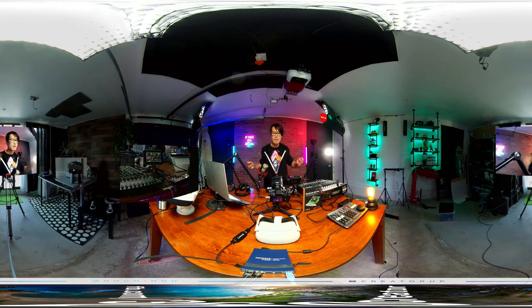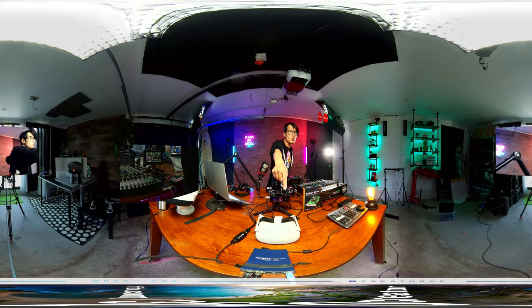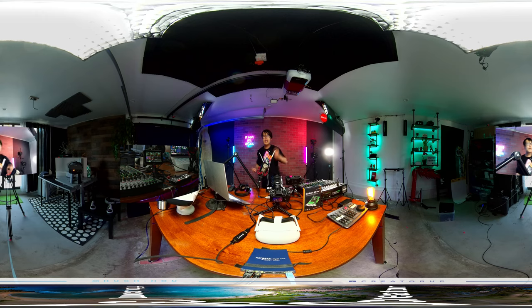And then different cameras, you just cue them into the set. By the way, everything has to be wired in. If you look down at the Qoocam 8K 360, you see the Netgear little box right there. It's a gigabit Ethernet router. So everything is hardwired with Cat 6 cable into the router, so we can run RTSP and NDI. So that's the next thing we're going to do right there. Let me switch to the next camera.